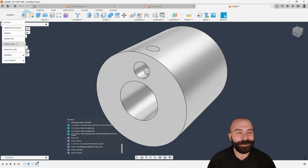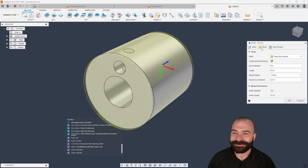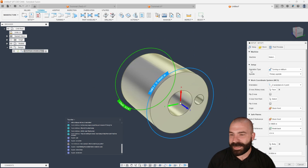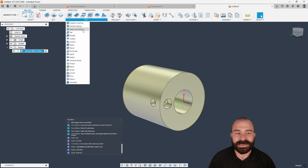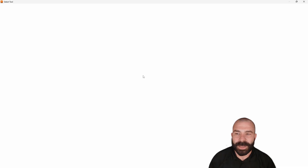So if we switch over to manufacturer, let's go ahead and get our setup — turning. We're going to use fixed size cylinder or fixed size tube because I'm a cheater, rounded up by zero, giving us our stock as if it's already been turned. You need to flip that Z axis, of course. I'm not going to add any lathe toolpaths; the goal is coming in and utilizing a milling tool. This is why deburr is going to be your best friend — grabbing that lollipop cutter.